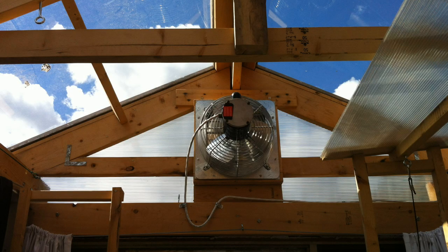We mounted a single simple light bulb inside over the greenhouse door. There is generally lots of light in the greenhouse in the hours that you want to be there — it comes in from the windows or it comes from grow lights. But sometimes you need to check something at night, so I put in one light. We installed an outlet on the north wall where I knew my automated vent would be, to draw in cool north air during the summer. We also ran a wire up to the south peak where my automatic fan would be mounted to catch the hottest air in the greenhouse and throw it out.